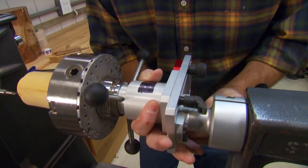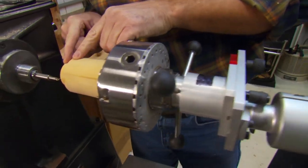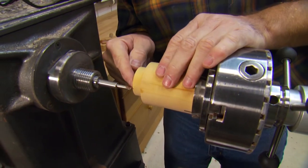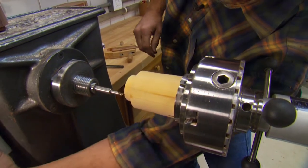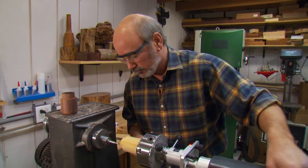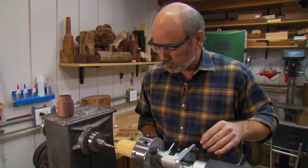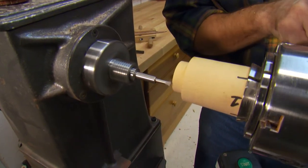and now we're in the right position to make the male threads at the right diameter, because when you look over here at the cutter now, everything is slid this way, and you can see we're going to start making some nice threads. So it's all locked in, all good. Get my control switch to turn things on. Got my goggles on, so I'm good. Start it up. Now we're just going to feed this slowly into here, just like we did on the female threads.